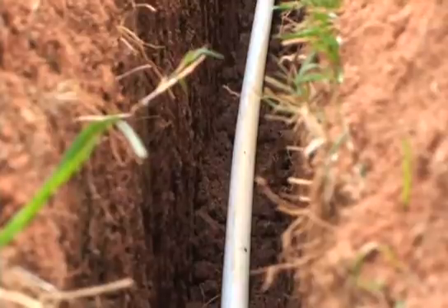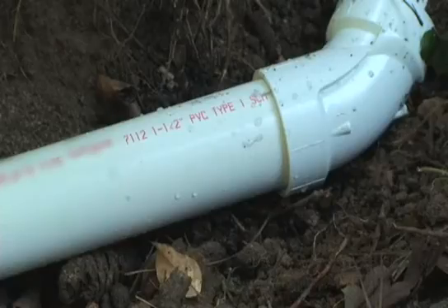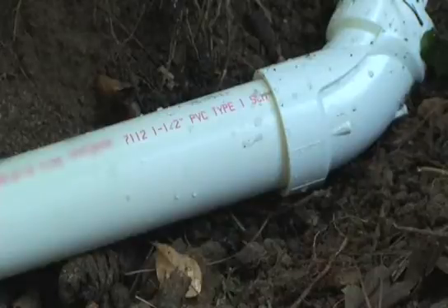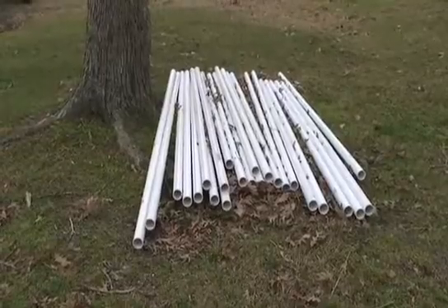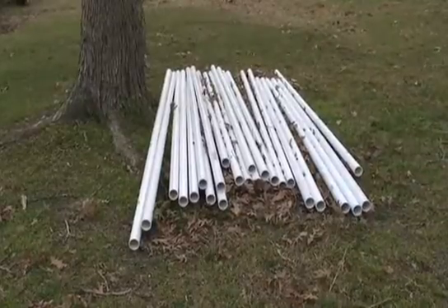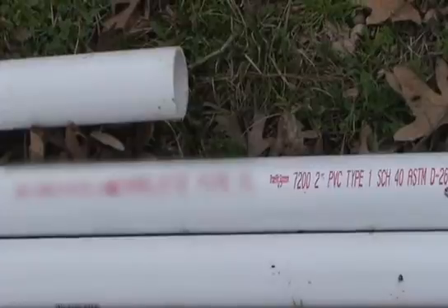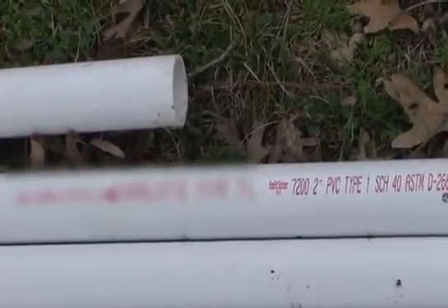Yes, the size or diameter of the pipe is what determines how quickly and how much water will be delivered to the tank. You'll have to consider friction loss in the pipe and also the operating pressures for the class or schedule pipeline that you intend to use. The better quality pipe you buy, the longer your pipeline will last. Pipes with thicker walls and made of tougher material are always the best choice.